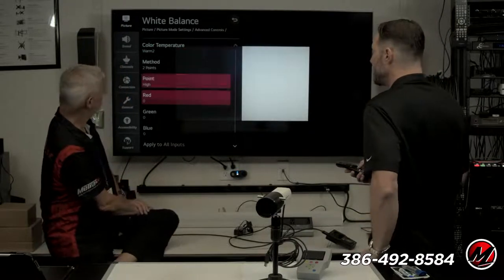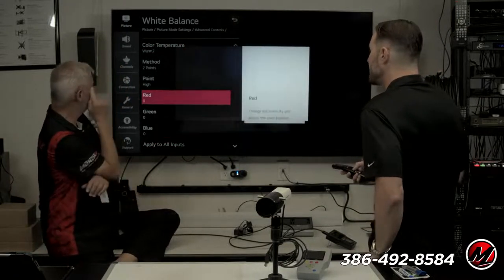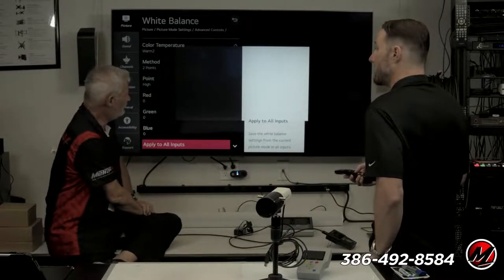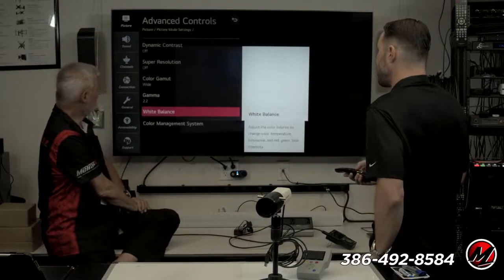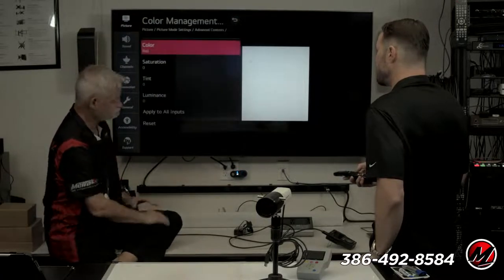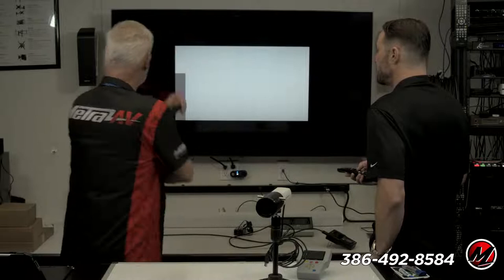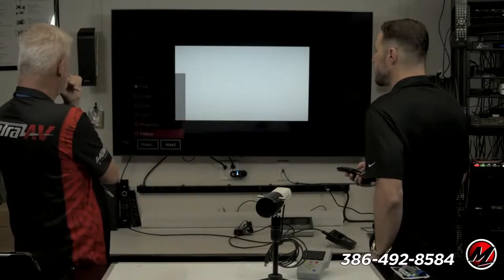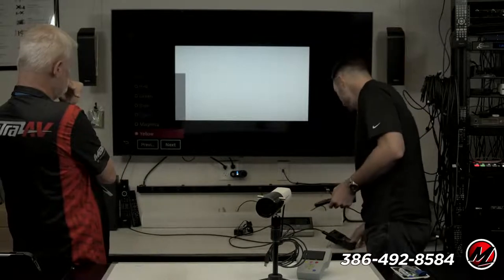So I have a couple of different things here. I've got my white balance adjustments. Here's another cool trick, apply to all inputs. So I don't have to calibrate every input individually. And then we have something called the color management system. So here I can pick red, green, blue, cyan, magenta, yellow. Those are the primary and secondary colors. And just so we can very easily see what happens on the screen here,